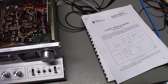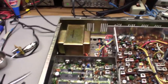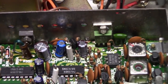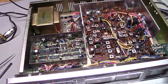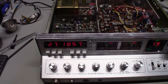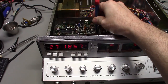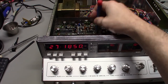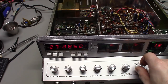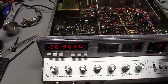The IC has been replaced — there's the old one, new one installed. Actually not so new — looking at the date code it's 1984, so that IC is actually older than this radio. Turning the radio on — we actually have a radio frequency now! It reads correctly. Switching modes — looks good. Changing channels — there we go. That's all it was: a bad IC.